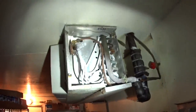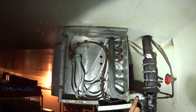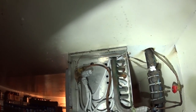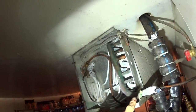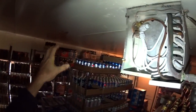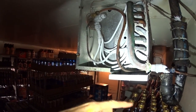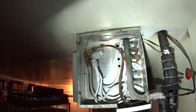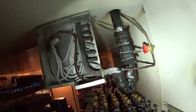I wanted to show this too — you can see how frosted this is leaving. Because it's plugged up, the heat is not transferring into the fins and into the tubing. It's so plugged up back there that the heat from the box — the cooler — is not transferring into the tubing. You can see how cold the tubing is leaving; the superheat is very low on this. I'll check it all tomorrow when I come back, and I'll set the delta T on the E-valve too. I'll get this thing cleaned out and working properly. Poor thing's a mess.